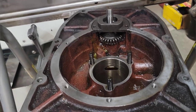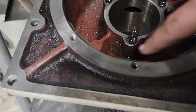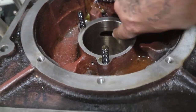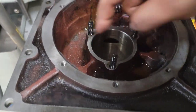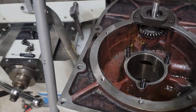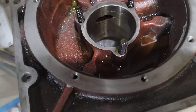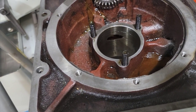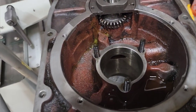This is our back gear housing - that's the next thing we're going to put on. There actually is an oiler here, and that fills this cavity - if you can see that - and runs through this hole. There are some oil grooves that would appear the oil runs around in, and greases your pinion for your back gear. I lubricated all this with Vactra number two. And then the bull gears are going to get grease. I got most of the old belt debris out of there. I did put some new oil in the cavity here just so I'm not filling all day through the little oiler.